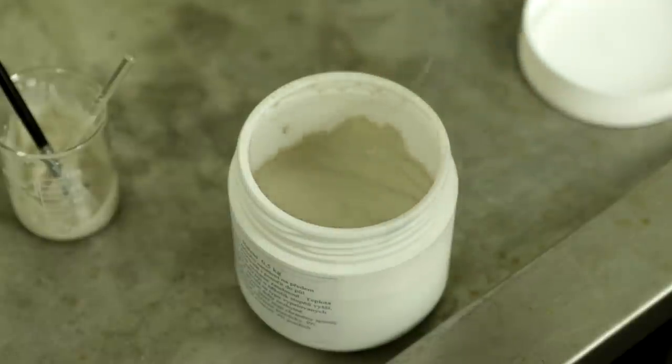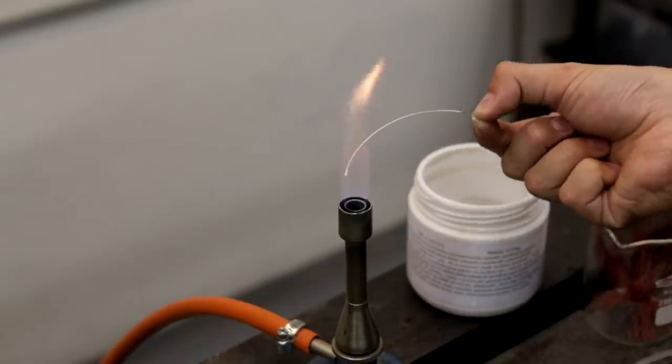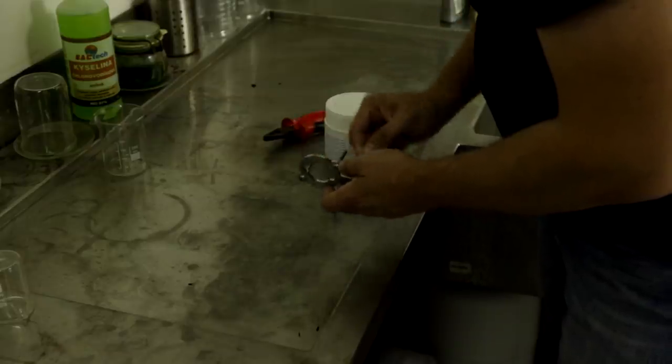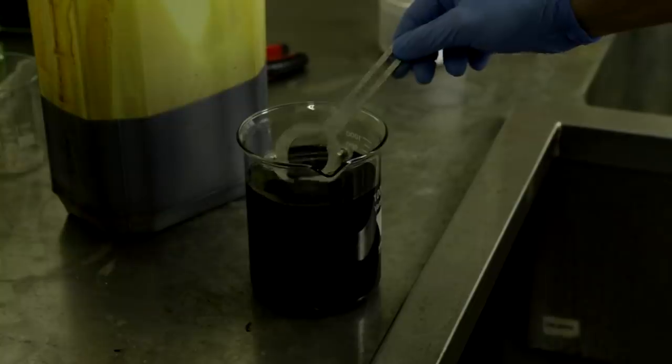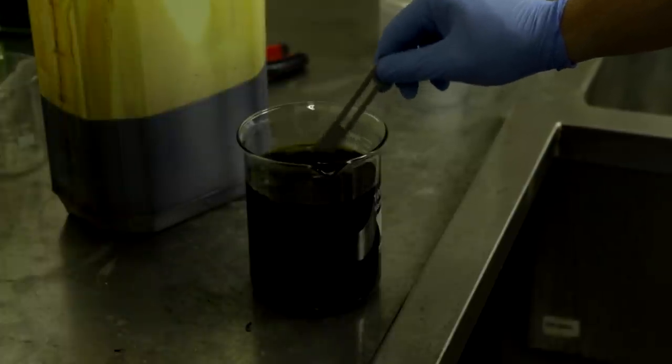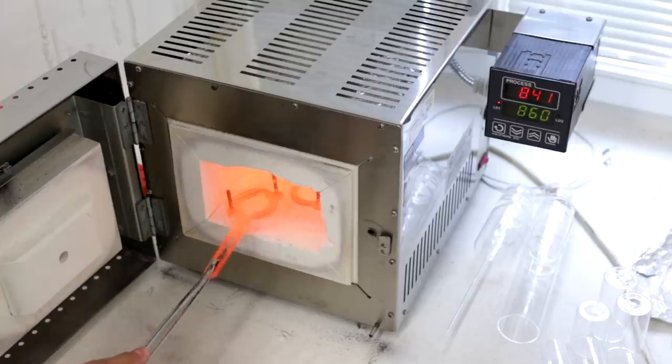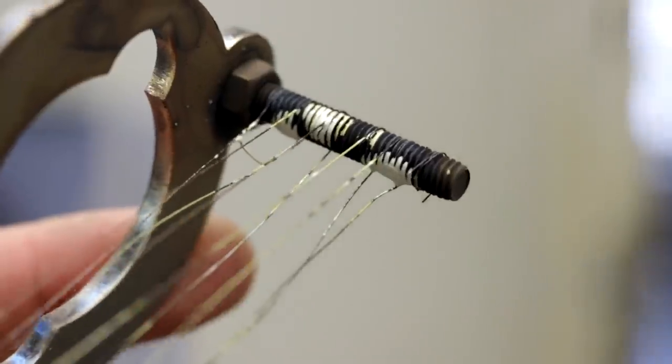I did several tests already. I also tried to come up with an application of ceramic coating on the wire myself, but it all turned out to be very laborious and difficult to make the adhesive layer really adhere well to the wire. Right now I think the best way would be to find some ready-made solution. It's not easy because we have really high demands — the wire needs to withstand 500 degrees Celsius under high vacuum without evaporation.